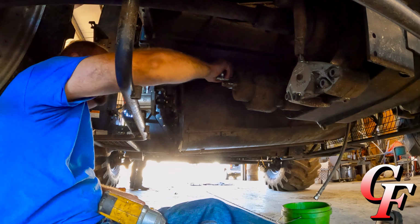the brakes. All right, we were having a problem with a parking brake not holding. Started during corn harvest, so we got our hydraulic park brake assembly right here. We've got our main disc brake right here, and then we got our secondary parking brake disc right here, and this is probably an overly complicated thing for the parking brake, but we're going to take this off and try to find out exactly why it's not grabbing. I can hear the hydraulics activating on it when I hit the button, but not holding the combine.